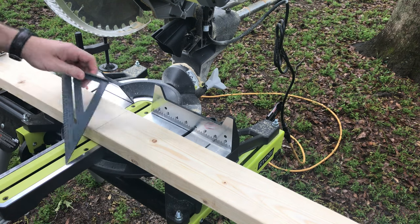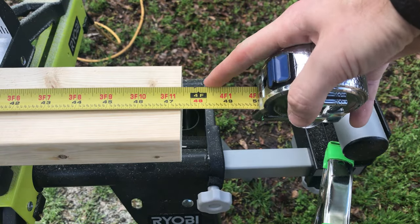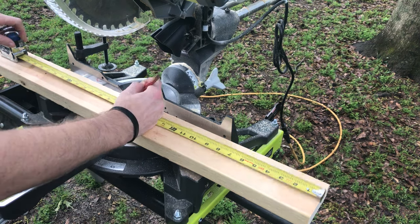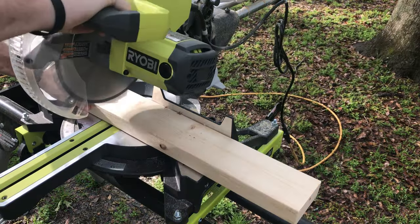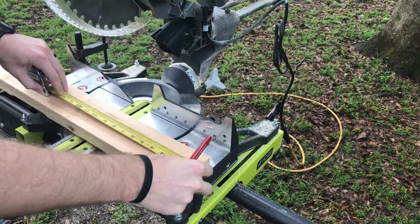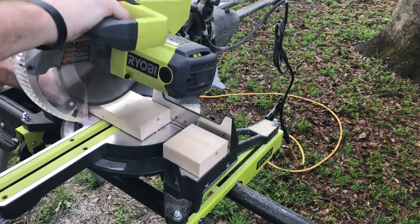That way you come up short on the upright piece, because it doesn't really matter if it's exactly 4 feet. The two side-to-side pieces are 17 inches — cut one out of one board and the other out of the other board. The four pieces in the middle are 3½ inches a piece, so two out of one board and two out of the other.